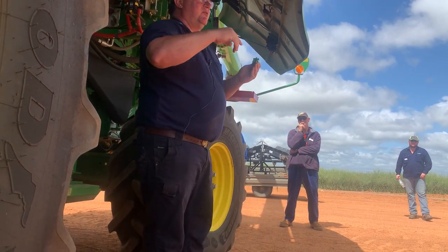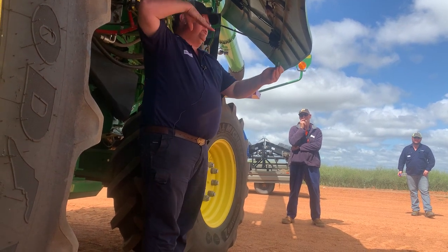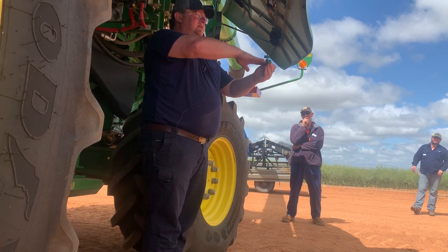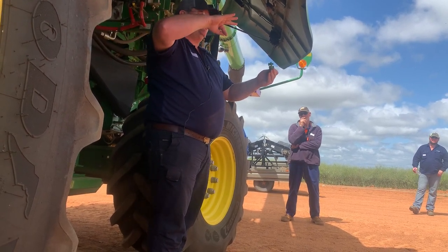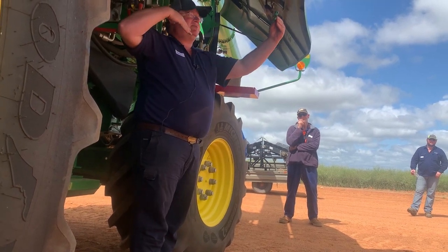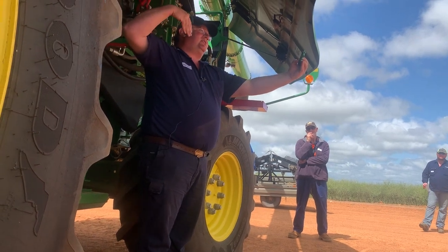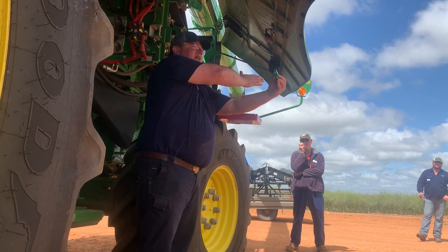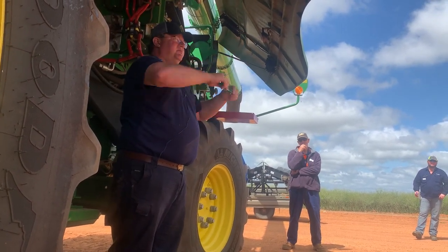So to get back to your question, where you put it in, we've got a bit of an idea that material comes in and hits the bar like that. That's incorrect. So we've got a tri-stream rotor. Material comes in 3 different ways or 3 different spots. So material can come in here. So this fellow is sitting on the top left of our concave. Material can come in on the top right and it can go through here and it will miss this bar completely. So that's why you need to spread it out through the whole concave.